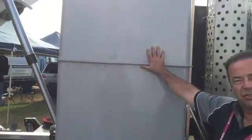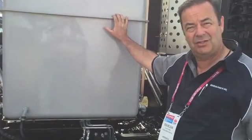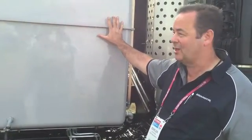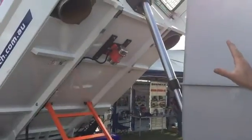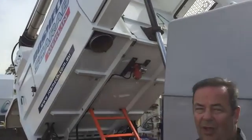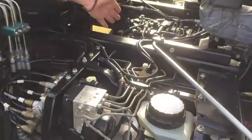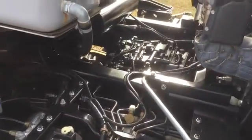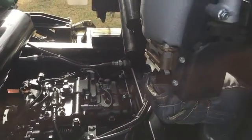We can fit a 1,250 litre water tank. We've done away with a lot of weight and payload issues on this truck, so it's basically just carrying its own water. Our hopper design is still the same. We've still got 5.5 cubic metres of capacity there to carry product and load. The whole unit is powered by, when you look into this area, a hydrostatic box. So this is a Hino FE truck, and it has a manual transmission, 6-speed. So we can drive this down the road as a manual vehicle.